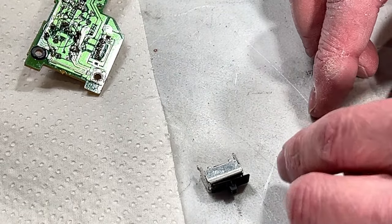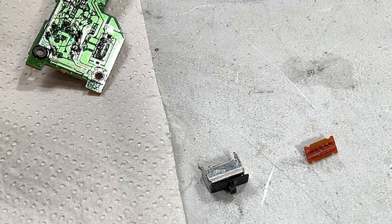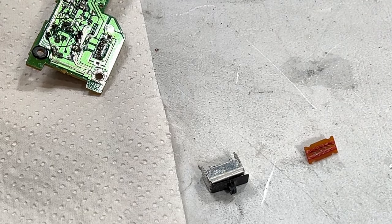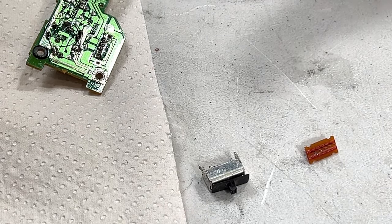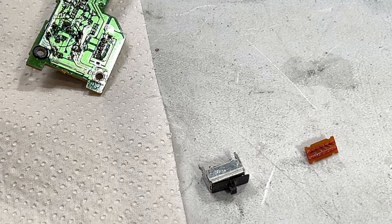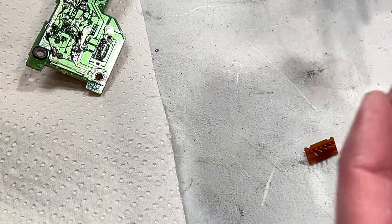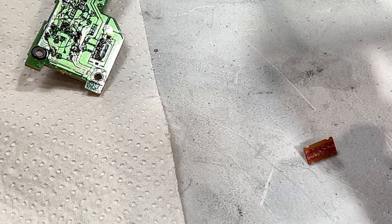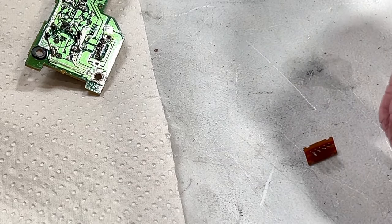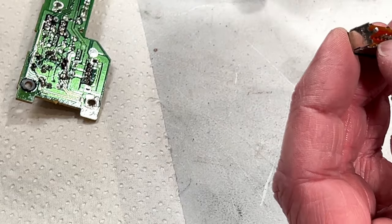The way it was it wasn't going to work properly again, so I just need to straighten out these four pins and I should be able to get this back together. I'll take a look at the contacts as well — they look a little dirty, so I might as well grab my DeoxIT D100 and give them a little once-over before I try to put this back together. Hopefully this is all she needs in order to be happy. The unfortunate part of working on this particular machine is that you have to take every single circuit board out in order to access this part of it.